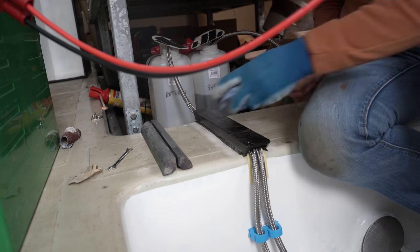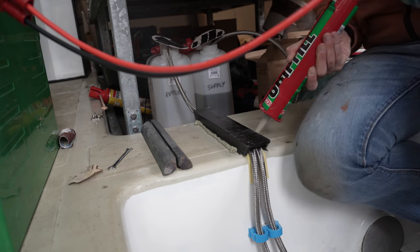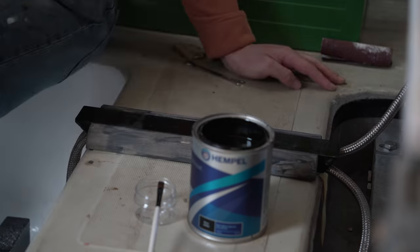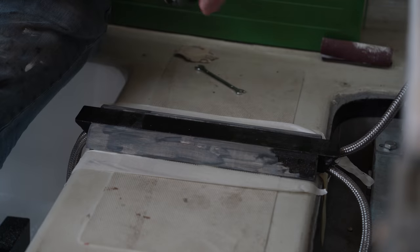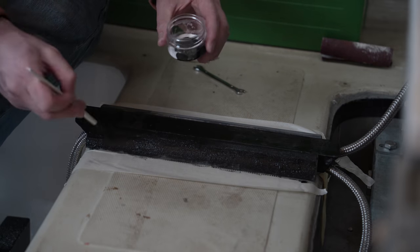I'm going to finish up with another precaution to avoid breaking any human beings on board Alan. The fuel hose trunking is a trip hazard, and so I've fitted two quadrants. These are just wood, soaked with a preservative and primer. Then I use a grab adhesive to fix them in place, and coat with a mix of single pack black paint and a pinch of anti-slip granules.